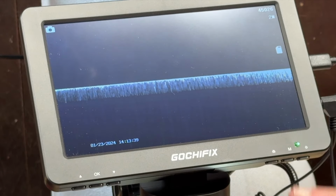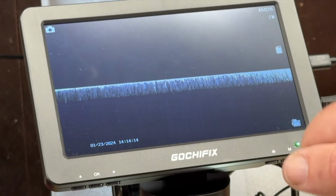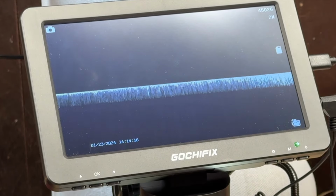Now, is it technically sharper? Yes, but like I said, it is a combination of things. So you're getting it closer to the feel of a razor. We all know when we shave with a razor, you don't feel anything, right? It just cuts straight through the hair. The hair just comes off on a really sharp razor. Where a toothy grind, it doesn't mean that the knife's not sharp. You're just feeling it grab. It has a little more grab to it. So if you're cutting like a tomato, it's going to grab that skin a little bit easier and cut. So that's the difference there.